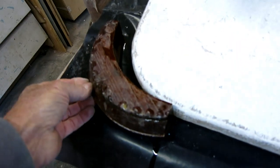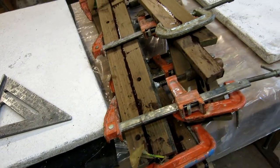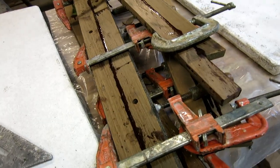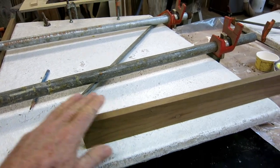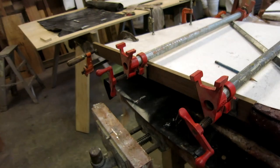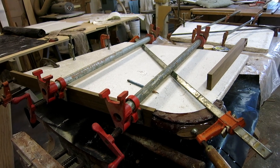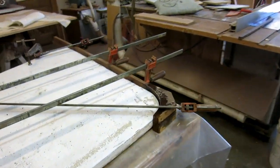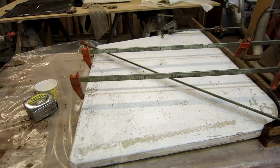I got the outside corners fitting pretty well and put a coat of epoxy on the inside. I got the two outside trim pieces — I had to glue them up because the stuff I had wasn't wide enough. There's the other curve, and it's very cold so I glued them this morning and it's still sticky. My edge pieces are glued up, run through the thickness planer, edge-jointed on one side, and table-sawed the other, so they're good stock. I've got them fitting but don't have a clamping arrangement where I can glue the three sides at once.